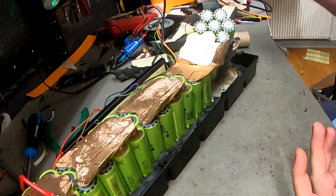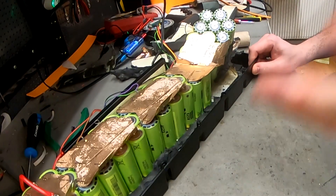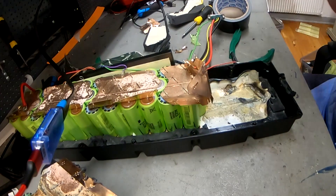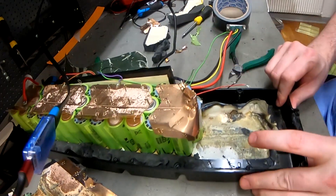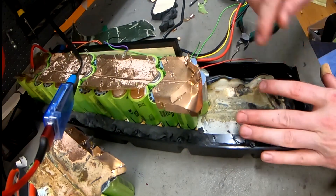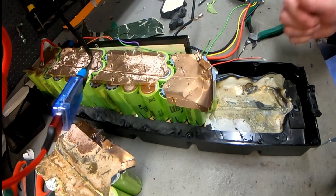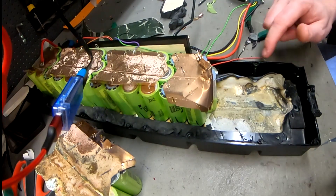This is no longer such a good-looking battery - it's beginning to look hacky. The GoPro died just as this was getting interesting. We wanted to remove the three last cells which were the damaged ones, but everything was so adhered to the bottom plate. When we bent it thinking we could remove the whole battery and just remove the last block, it came apart and we nearly got a short circuit because the strong adhesive damaged the heat shrink tubing.